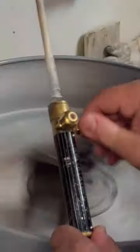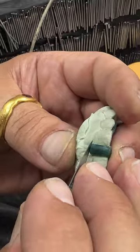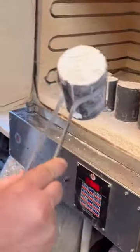What you're looking at right now is part of the production process of making golden diamond grills. It starts with the molding of the teeth, and then we carve out these waxes which we turn into gold. This is pure gold — we want to dilute it down to 14 karat, and we're ready to cast it in one of our molds that we made with our waxes.